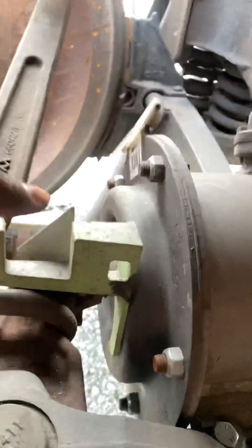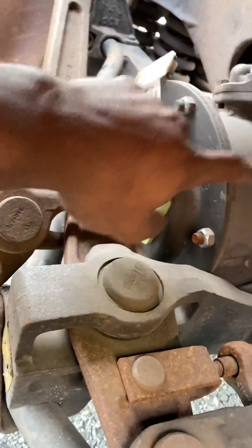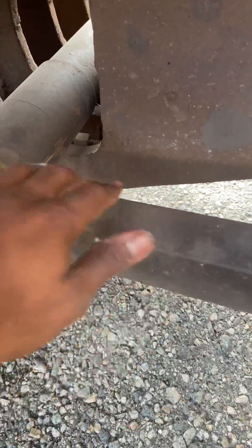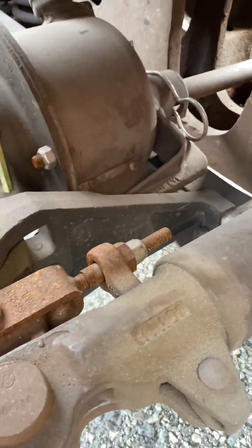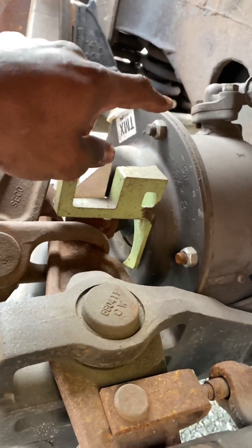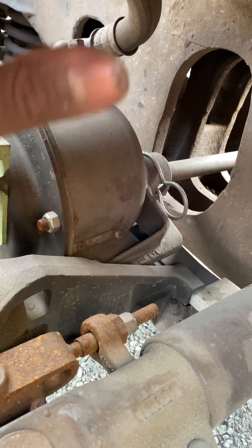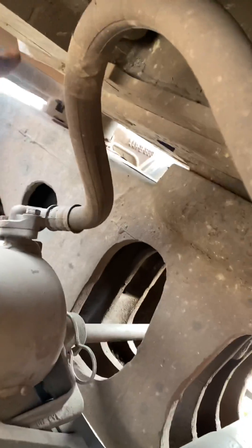You can check the batch plate to see which size goes on what brake system. These ones require a special brake beam — it's got a dent on the compression member to support the weight of the cylinder, because with these brake beams the cylinder is mounted to the brake beam, whereas standard cylinders are usually mounted to the bolster.